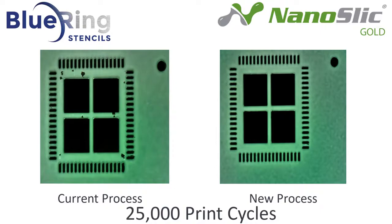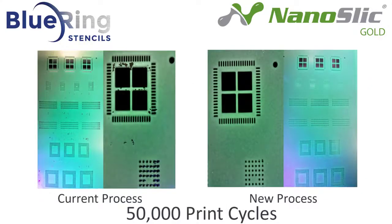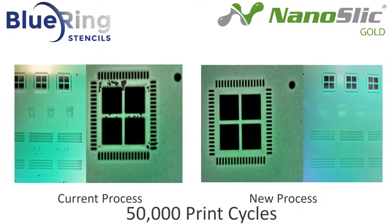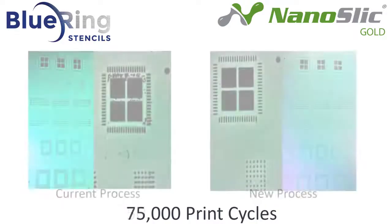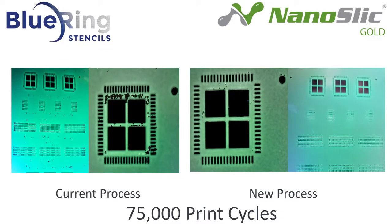For many of our customers, this would be the lifetime of their stencils. However, we do have customers printing many more boards than this, so we continued our testing. Looking at these images after 50,000 print cycles, the current process continues to degrade, and it's difficult to see a very few small chips in the modified surface coating. At 75,000 print cycles, you can see the current process continues to degrade, and we start to see some small chips around the QFN and micro BGA on the modified surface coating.